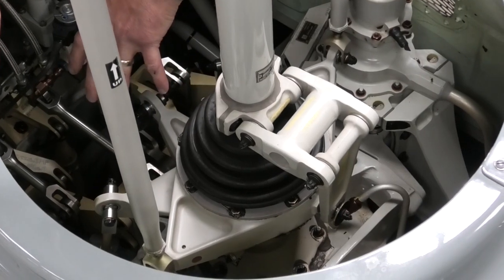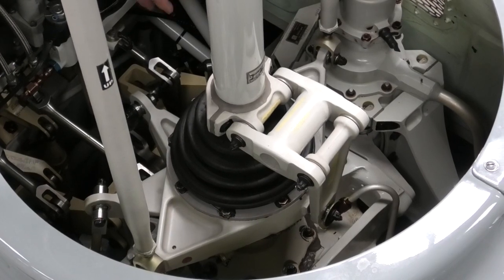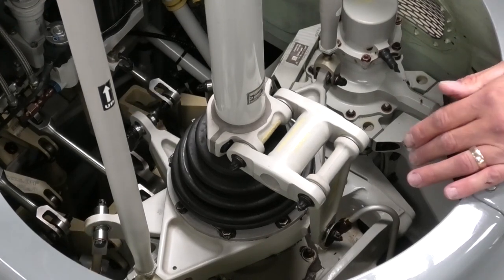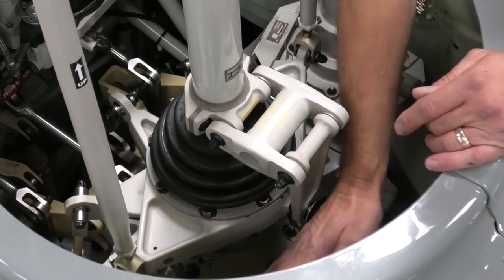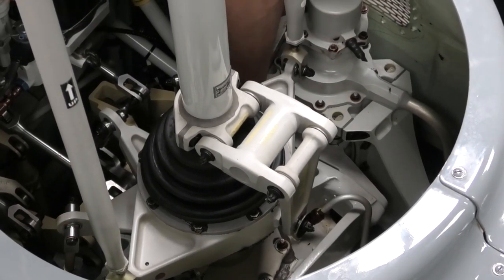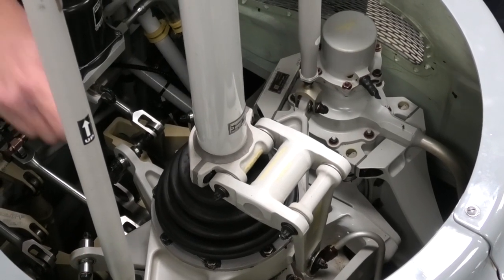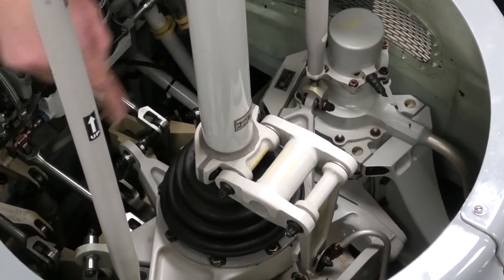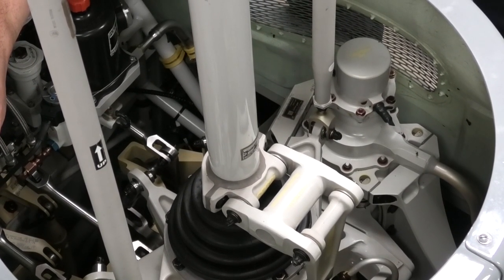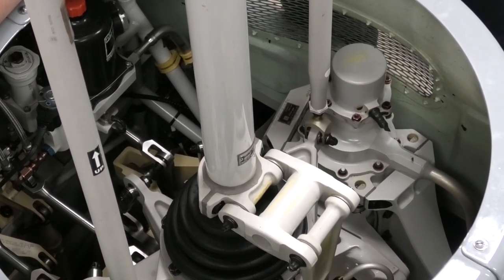We look down the bottom of the transmission area to check if there's anything that's got in the aircraft — birds do like to nest in very warm transmissions after flights. We check the top level of the transmission area, looking for any kind of oil misting around this area, and check the cap is secure on the top of the transmission. Next item to check are the two live mounts, one on either side. The live mounts are what give the 505 its really smooth flight characteristic — live mounts are also fitted on the 407 and the 429, so you're getting some really good tech on this aircraft.